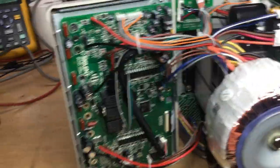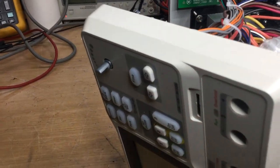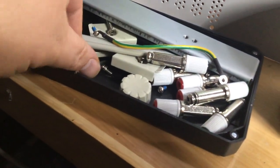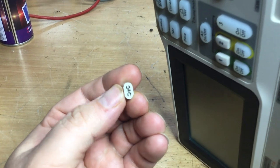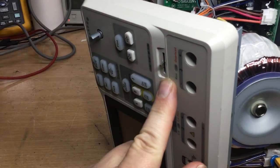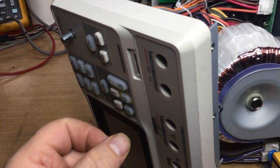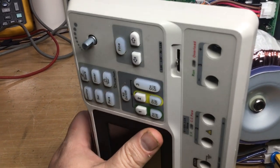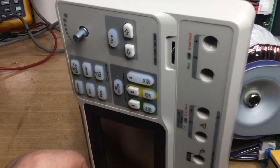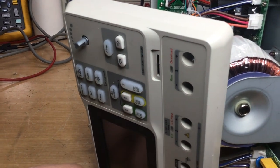Now on the front, we looked at that switch earlier, which is this slider switch here, and the little knob part which goes on the front, and that's it there. Now that's what it looks like inside. It's only tiny, but when you pry that off, you're best off using a plastic spatula rather than a screwdriver, because the screwdriver could scratch the plastic or indent or chew it up, because it is quite difficult to get it off. So use a plastic spatula or a car trimming tool, something plastic, non-scratching, no metal, otherwise you could end up scratching the surface of the plastic bezel at the front.